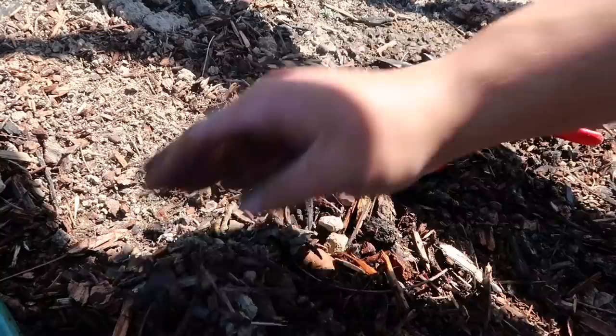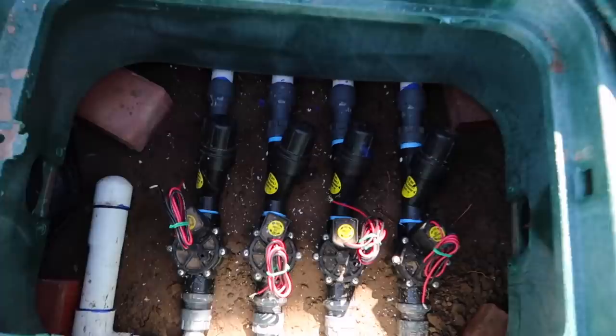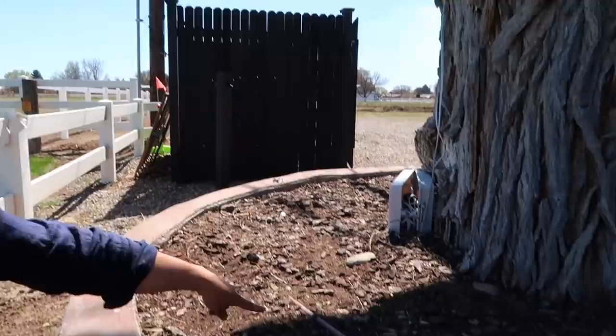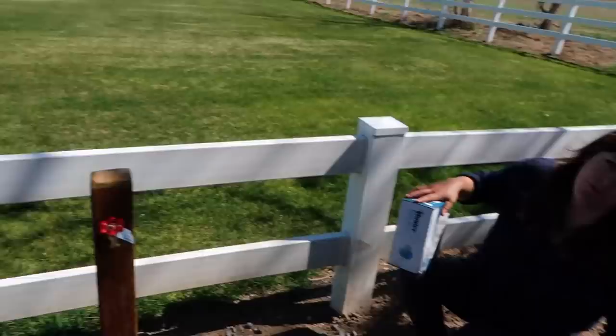Along this east fence line we used to have just one faucet about two-thirds of the way down. To clean it up and have water access on both sides, we had a faucet put on either end and then another one of the nodes put in here. This is an example of how you can put it all in one box instead of two or four like we have in other areas. These three zones are unused, so we're going to use them for the trees that are going to line the driveway, and the fourth one has already been plumbed with a line running behind all of these containers. We'll eventually have that drip line running underneath the pots up through the drain hole so you don't see the tubing.